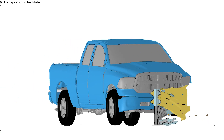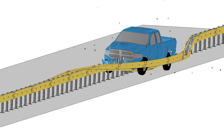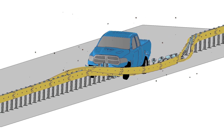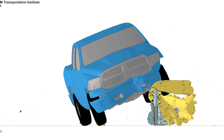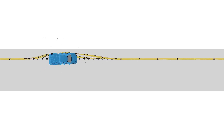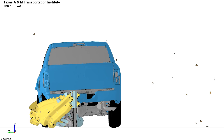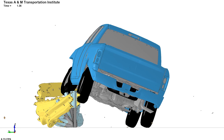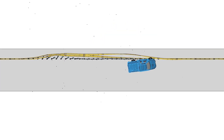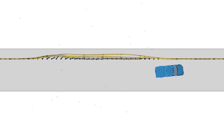A key design aspect for this system was to look at how the post detaches or deforms where it is attached to the concrete. It is important to have the right release or right deformation of that post. If it deforms too quickly — if the connection is too weak — then your whole guardrail will be very weak and it might not actually prevent the vehicle from breaching and going to the opposing lanes.